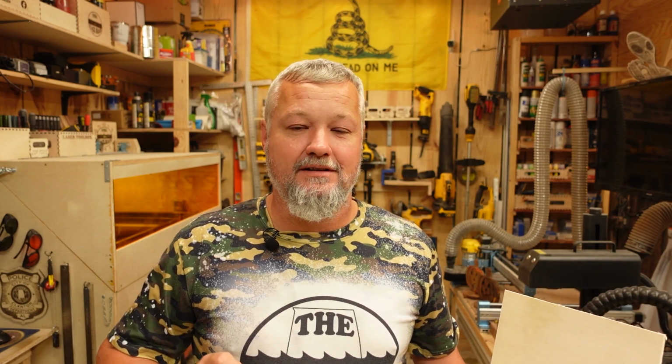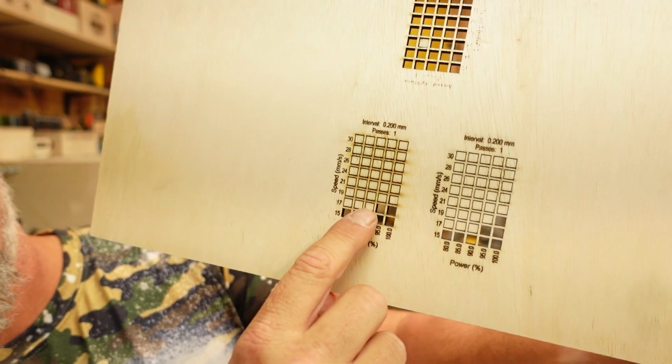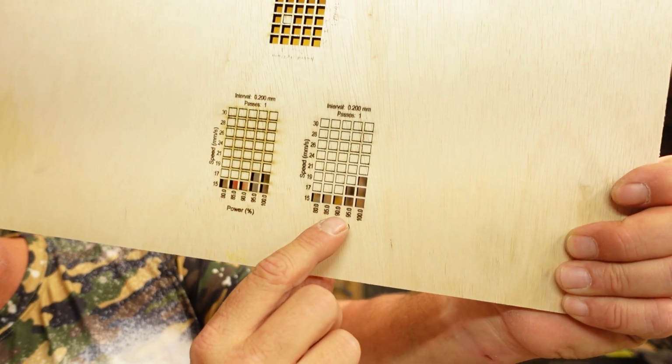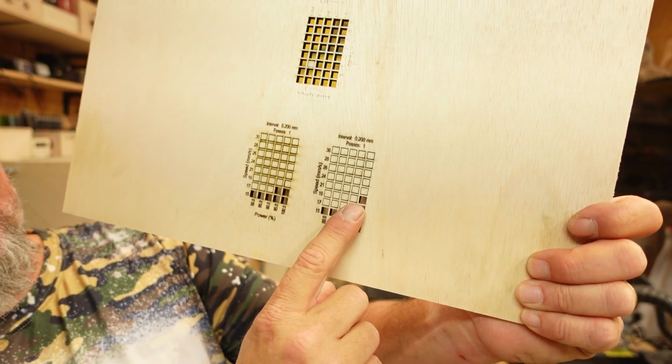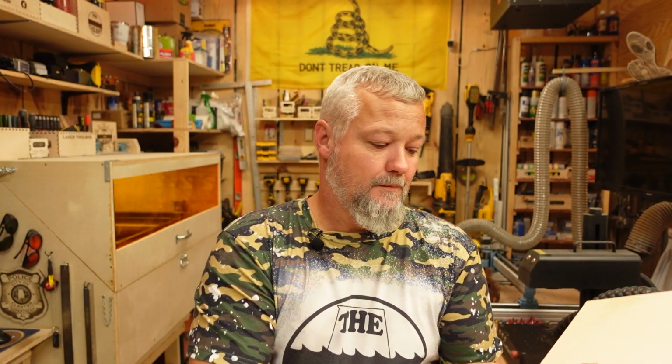So there's going to be some engineering involved to get it to operate my M8 relay in the enclosure to use my air. Because like I said, their air assist pump works well. As far as the cutting ability, no big difference, but you can tell an obvious difference in the cleanliness of the cut using my 10 PSI of regulated air. So I will be switching it over to my regulator as soon as I can get it in there.